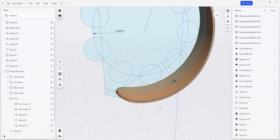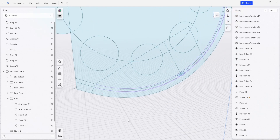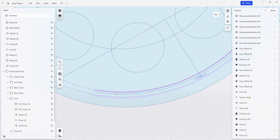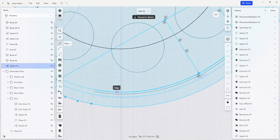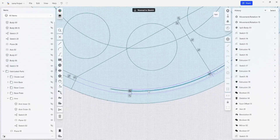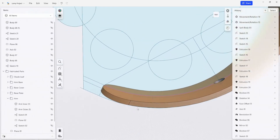The router bit that we originally used trimmed the overall shape of the arm, but it didn't create this fillet here. So I need to create a feature that is behind this fillet so that it doesn't get in the way when our template is used to cut this feature out. I'm going to hide this arm and just put a line here to help subdivide this little area, going between these two edges and making it vertical. We can double check that that edge is behind our fillet area, which it is.